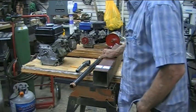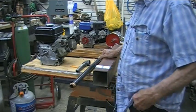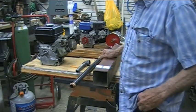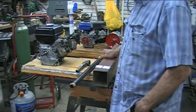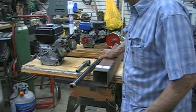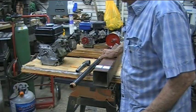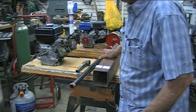However, Larry and I have come up with the idea that we're just going to put an electric heating element in it. I've already ordered one of those, 12 volt, 50 watt. I'm hoping 50 watt will do it. If it won't, I'll order two just in case, because if 50 watts won't do it, then we'll just put two of them in the gas. And with the electric element submerged in the gas, we shouldn't have any problem at all with fire.